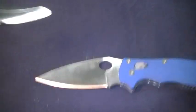It's all smelted and then it's forced through a small orifice and sprayed with nitrogen gas where it forms these small micro ingots. And then the micro ingots are induction forged, HIP forged together, and then rolled to make the knife steel. How's that for you? Is that technical enough?